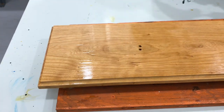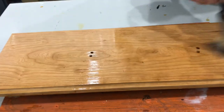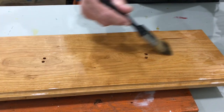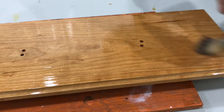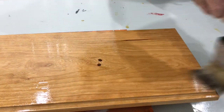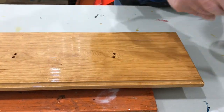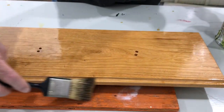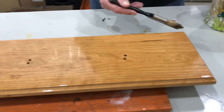When you're pulling your brush while varnishing, you want to be careful not to pull it over the edge, because then it runs down the side. I always go back over all the edges when I'm done. You could still get runs going through those mounting holes that he drilled — two are bound at the back but two go all the way through, so I use a little artist brush to look underneath and catch any drips onto the back. As I go over it the last time or two, I put very little pressure on the brush. That helps it to not look brushy when it dries and smooths it out.